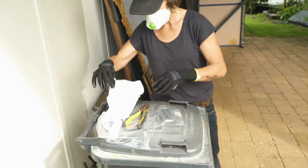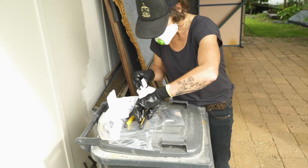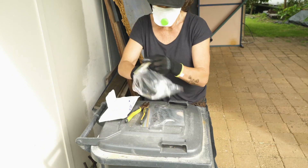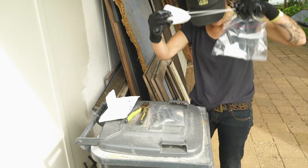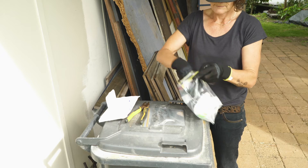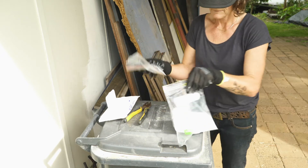At the sampling spot, paint any damaged or exposed material that may potentially release dust. If taking another sample from a different location, complete the previous steps one to five. Then clean your hand tool thoroughly with a wet wipe, and place the wipe, the mask, and the sealed and labelled sample bag or bags into the largest zip-lock bag and seal it securely.